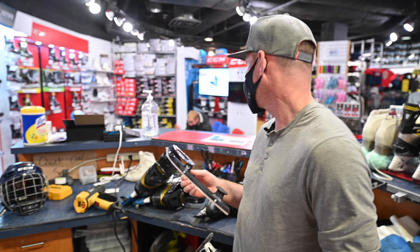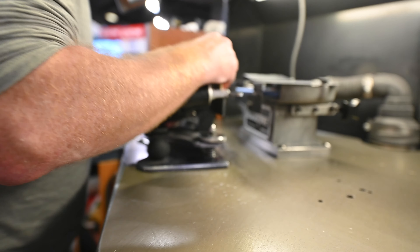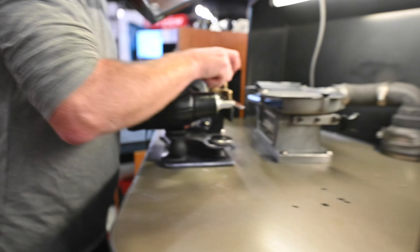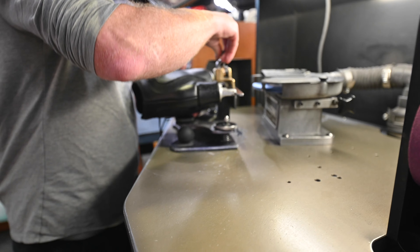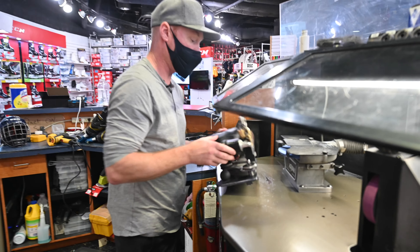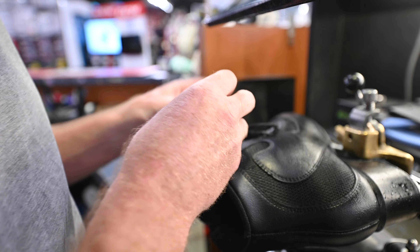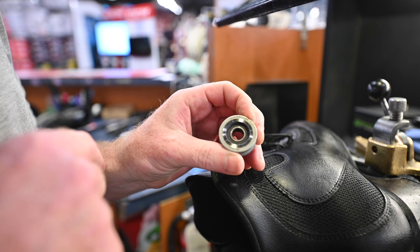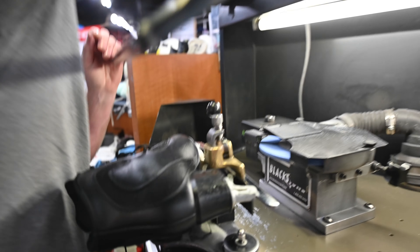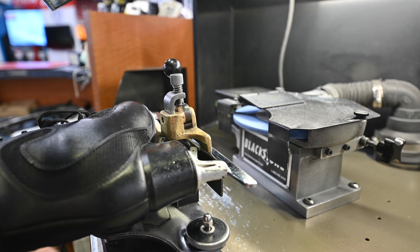You can do tricks on that — this is really cool. So he likes half inch. We're going to throw it on a traditional jig. Unlike Matrix skates, he's got like no blade left on these things. He needs new blades for sure because these are worn down quite a bit. So we're going to check our Blackstone wheel. I'm going to look at the wheel — this is three eighths. Three eighths is super sharp. He doesn't want super sharp, he wants a half inch. So we're going to take a half inch wheel, a spinner, and put it on there and fire up the machine.